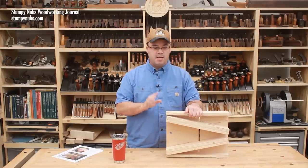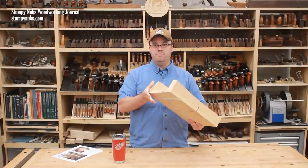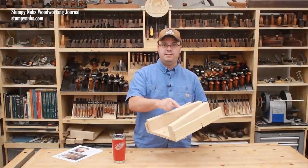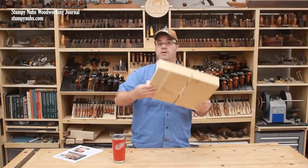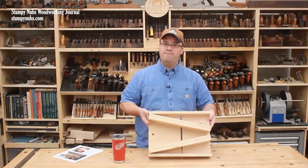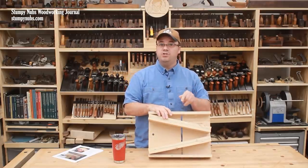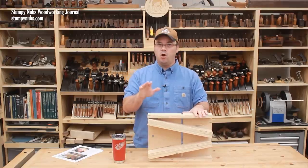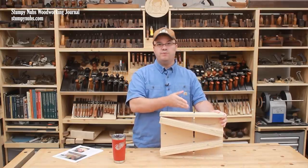First, let's get a closer look at the jig. It's built much like a simple table saw sled — there's a base panel with a couple of cross pieces and two inner fences set at angles. On the underside there is a runner for running it into your miter slot on your router table, which aligns the jig so that a half-inch router bit can cut a kerf down through the center the first time you use it. This kerf becomes your reference for aligning your cuts, so you'll always want to use the same half-inch router bit each time you use your jig to preserve that kerf.